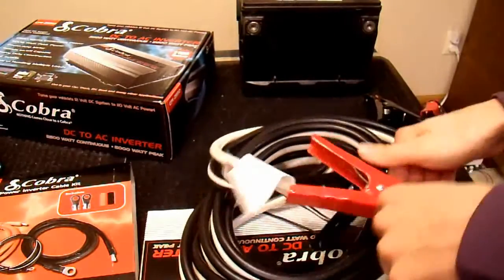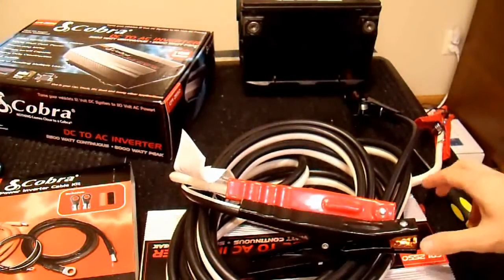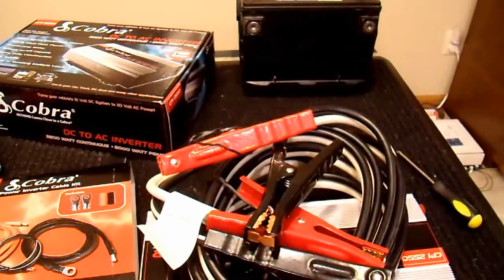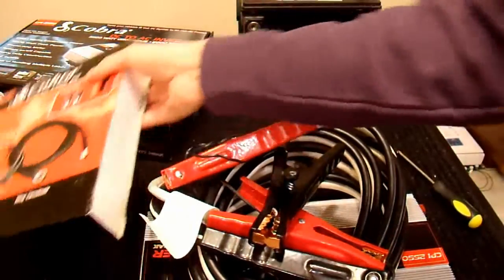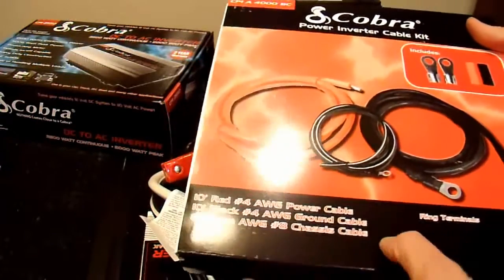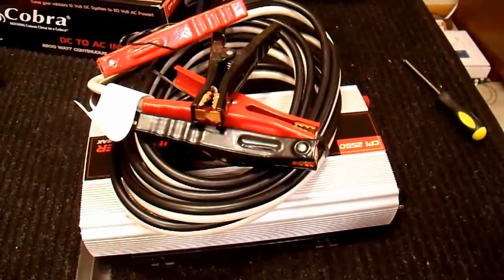This is 20 feet of 4-gauge cable and it comes with battery clamps on both ends — these are Deka clamps, American-made, so this is pretty good quality cable. The wire is nice and flexible, the crimping into the cables is good, and the clamps themselves seem to be pretty good quality. I like the way they're constructed where the cable gets crimped directly into the copper piece, versus some other clamps where you crimp the copper onto the clamp itself and then the current has to go through the clamp to the copper piece — that's not a very good way of doing it. I'm going to use these, though it does seem like a shame since this is a 20-foot cable and I only want about 4 feet from my inverter to the battery. I could also cut one jumper cable into two roughly 4–5 foot lengths, put the terminal rings on, and fully populate all of the lugs on the inverter.